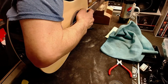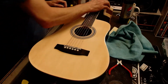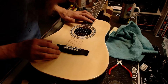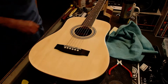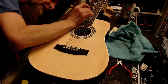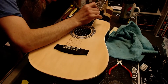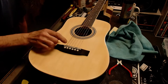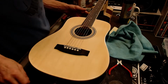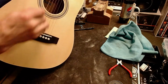Now we're talking. Again, this is going to go into the hands of a brand new guitar player, so it's very important that I make sure that this thing feels correct. And this is going to take a bit more work than just a real quick little wham bam. Our string action is 8/64 at the 12th fret on both sides of the fingerboard, so I need to remove 6/64 off of the saddle, which means I need to measure and cut this thing. I need to take some off of the saddle on this to get this right.